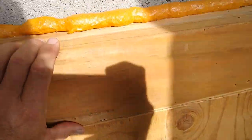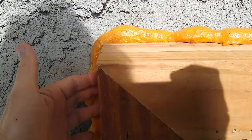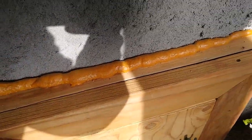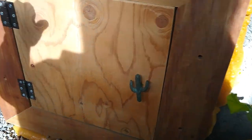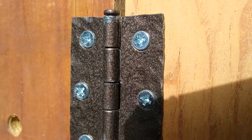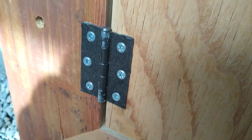This is just pressure-treated two-by-six for the outer part and a two-by-four ripped down to about two-by-two for the inner part. I misaligned my holes so they don't match where the boards tie together, but I can plug those later with great stuff, then trim and paint. For the door hinges, we took plain silver hinges from Ace Hardware, distressed them by pounding with a hammer, then painted them with a hammered bronze spray paint so they look old and worn.